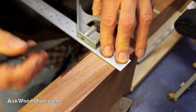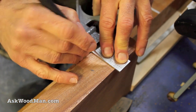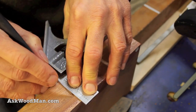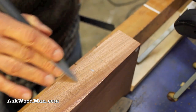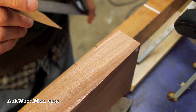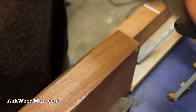This is a piece of 8 quarter, probably 1 and 3 quarter inches across. I'll show you how you just take a sharp knife and scribe your line where you want to end - I'm just kind of spitballing here. This technique will center the mortise exactly in the center of the board regardless of the width of the board, so it's a really good technique for cutting mortise and tenons.